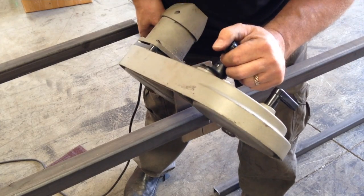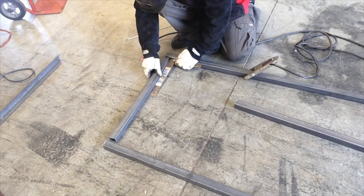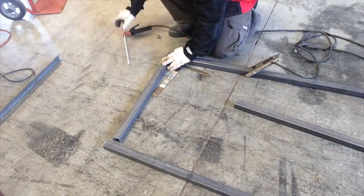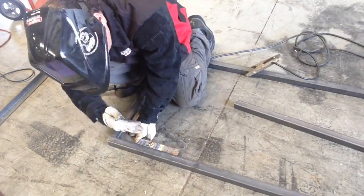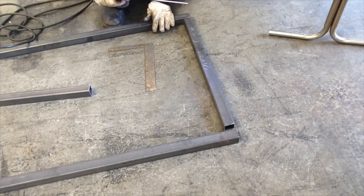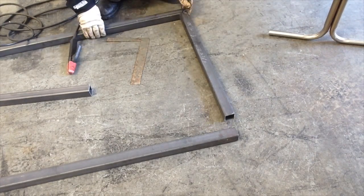The port-a-band is really handy. This is a Porter Cable brand — I think that's the original brand — and it cuts through this square tubing and angle pretty well. Now I'm on a concrete floor. You have to watch out for some things when you're welding down on concrete — mainly you don't want to get the arc down near the concrete because it's dangerous. Moisture will expand and it'll pop out a big chunk and hit you in the face. But I'm just getting tack welds on top of this square tubing, so I'm not in any danger of concrete popping loose.